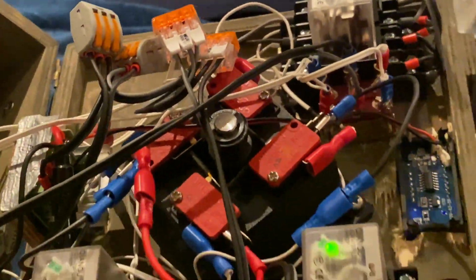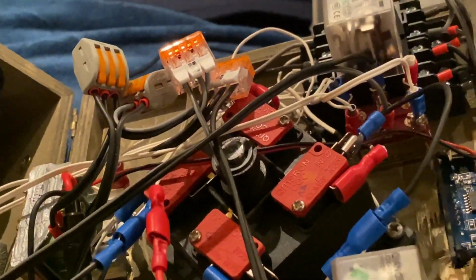They had a little too much empty space, so you really had to press them far down in order to press the button. And so I put a little bit of tape around them with a little piece of wood inside here in order to decrease the leniency of this whole joystick. Otherwise I really would have had to press both of them down in order to get both engines running at the same time. Either way it would have just been one engine at a time, and this way the response is much faster.